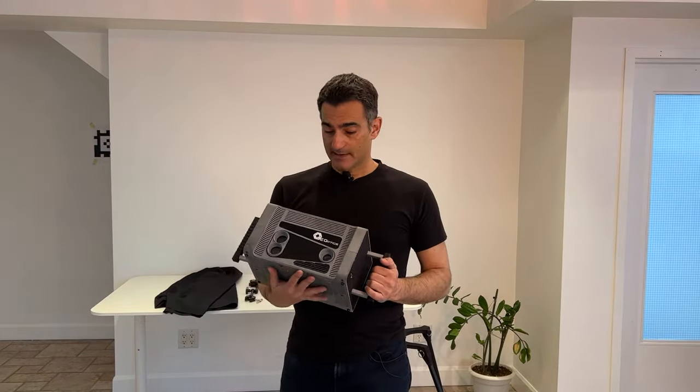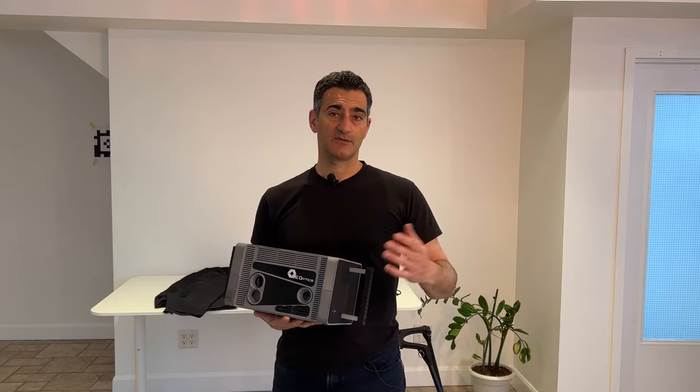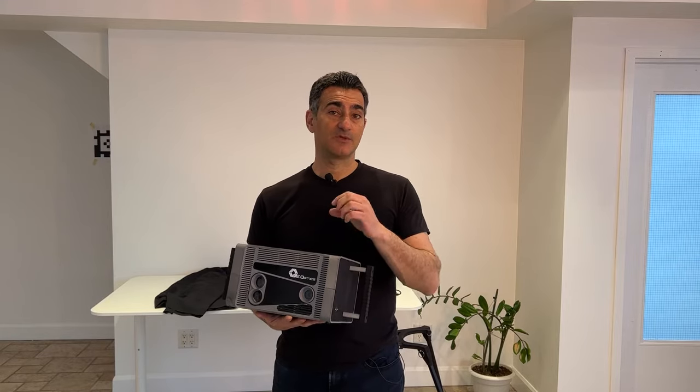I've done some other videos on structured light scanners. When we talk about structured light scanners, what do we mean? Structured light really just means that we're doing something to the light so that we can interpret the position of 3D geometry. Sometimes you can use lasers, sometimes you can use white lights — just like a regular projector. In fact this one is a white light scanner, so you can visibly see what the pattern looks like.